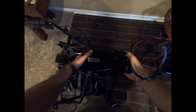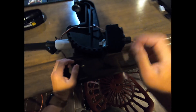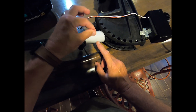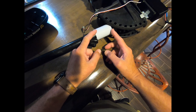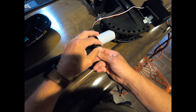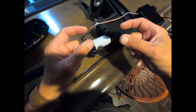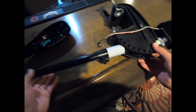Let's get this up on the workbench. This is a part I made the other day — my first try at Fusion 360. I designed it because I was running into binding issues. I had the motor mounted on the front of my pond prowler, and this part was hitting when going left to right. I ended up having to add a 1-inch piece of wood spacer to push it out just a little bit from the boat, and it worked out perfectly.